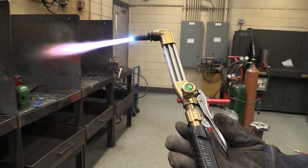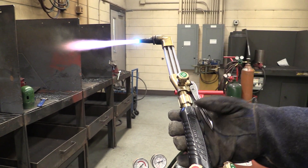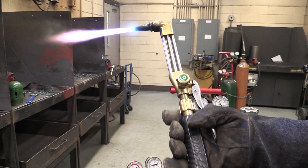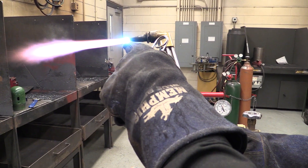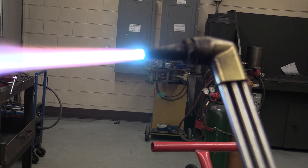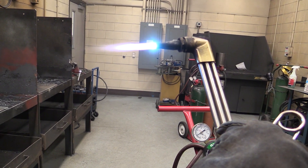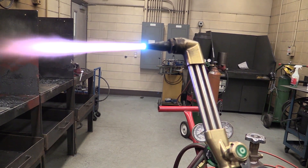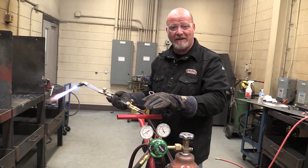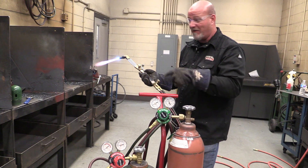The only other thing to talk about is the lever. When I hit this lever, I'm going to have a direct blast of oxygen going through the center of the tip to blow the molten metal out of the way. What you don't want is for that inner envelope — those feathers — to be loose, because when I push the oxygen, it's not going to direct the oxygen correctly for a nice clean cut. So I want to push the lever and then adjust the oxygen to pull that feather down in tight. At this point, I'm ready to start cutting. My flame is adjusted correctly, my working pressures are good, oxygen works great. Stay tuned for another video on how to actually make the cut.